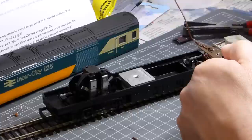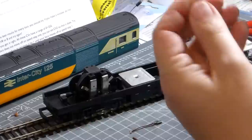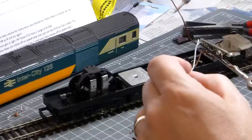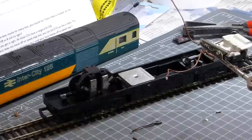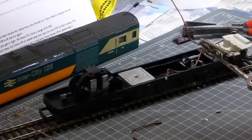The first two wires are now ready, having been soldered up. Changing over to the other connection which has the remains of the diode lead sticking out — that should form a nice contact for soldering. Run a little solder on there. Dropped a bit on the mat but that's what it's there for — nice connection on there. Get rid of the vapours, which are not nice to breathe. We've now made the connections ready to attach back to the motor, and all we need to do is start putting the harness on.